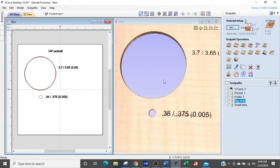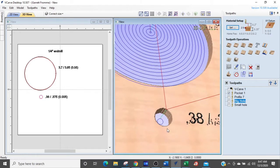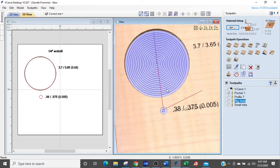As a beginner, you'd normally cut both circles in the same pocketing toolpath. A pocketing toolpath comes into the middle and interpolates outward until it reaches the final diameter, making a final pass — then does the same on the small hole. The large hole has a lot more surface area being cut out; the small hole is very small, which matters for the next point.